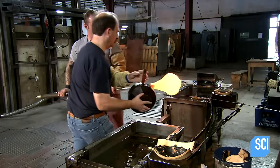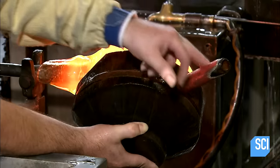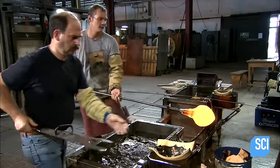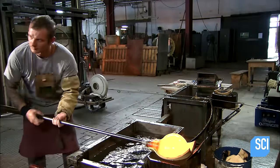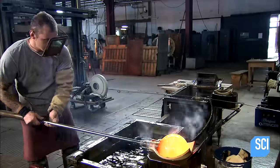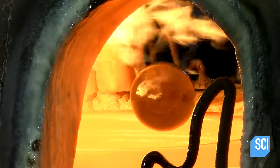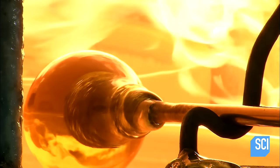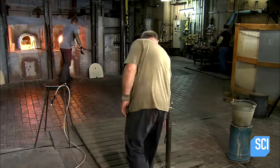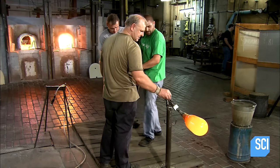This time, the assistant shapes the glass with a large mold. When the shape is set, the assistant prepares it for blowing, using a fork tool to push the glass to the top of the pipe. The starter rotates the glass in a larger paper-lined mold to round it further. The molten glass cools rapidly once it comes out of the furnace — if the temperature dips below 1,800 degrees, it's no longer workable, so the team must work quickly and reheat the glass repeatedly. Another assistant lubricates the blowpipe so it will rotate easily on the support stand.